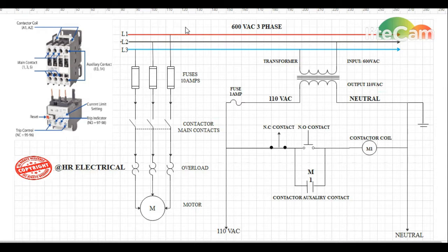Now let's have a look at our wiring diagram. We have three phases L1, L2, L3 — this is 600 volt three-phase power coming into the plant. From all three phases, the power goes on top of the fuse holder. We use fuses to protect our circuit, and the fuse rating depends on the load being consumed by your application. These three lines L1, L2, L3 will pass through the main contacts of the contactor when the coil is energized.